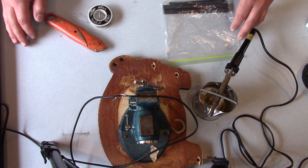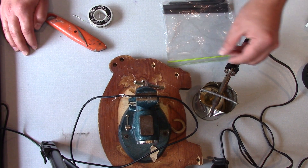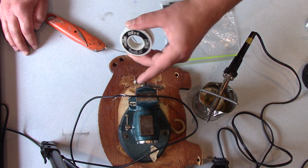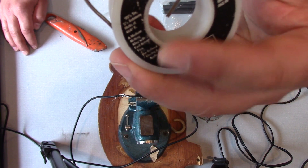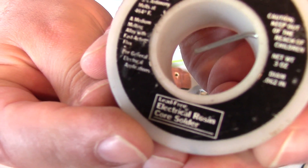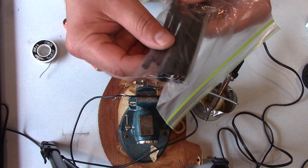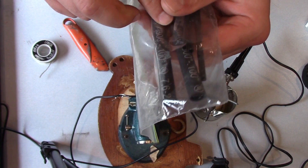You're going to need a few items. A small vise is really handy — some sort of way to hold the wires. This was my dad's and it works really well. You're going to need a soldering gun or soldering iron of some sort. You'll need lead-free solder, preferably smaller gauge for the smaller wires. I do have some smaller stuff, but it's silver solder and silver solder melts at much higher temperatures, so we don't really want to use that. Make sure it says 'electrical rosin core solder' — that's what you want. You'll also need some shrink tube or electrical tape.